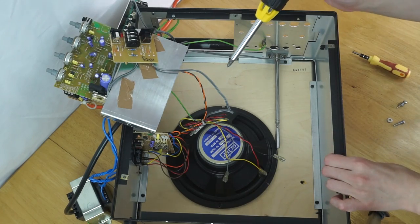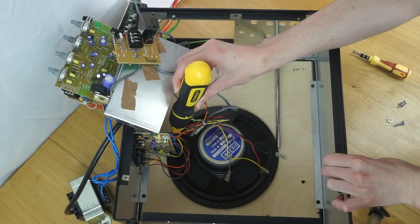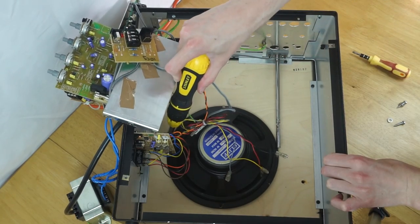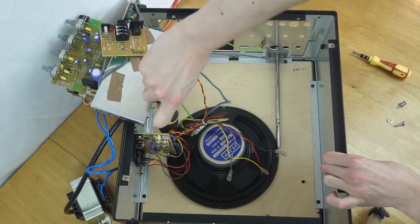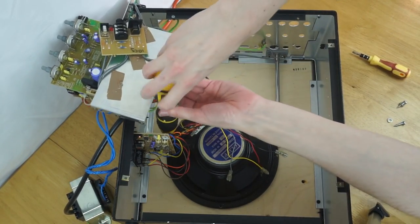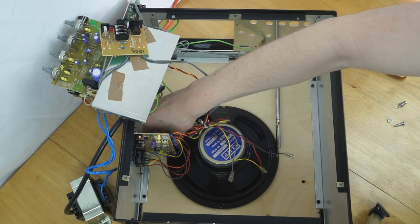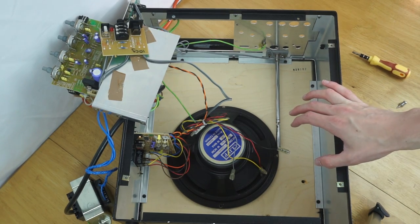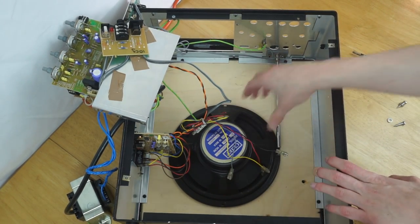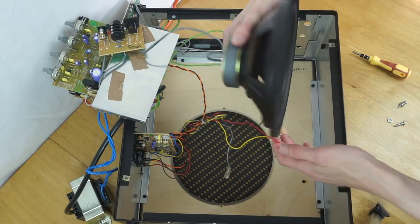And the screws under that battery charging board. And maybe squeeze inside. Let's see. Yeah, I'm being very careful. Just about fit that into the battery charging board. That was an annoying thing there, I've had to remove that. But yeah, that's all those screws out, so hopefully I can now remove the main speaker. So, yep, that's loose. So, shift the aerial up, and that just pops out, there we go.